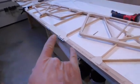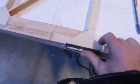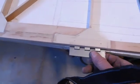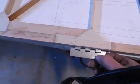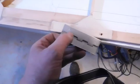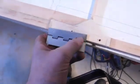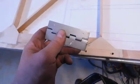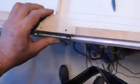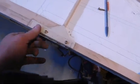I've got three hinges in and I'm just putting this one in now. The hinge is in there and I've got the two spots marked where I'm going to put the screws. Then I just take a drill and drill through the wood and just start going into the metal. Then I'll pull the hinge out and take it to the drill press and drill it from there. I drilled those out - you pull this out and you can see just the little nubbins. That's where you take it and drill out to full size on the drill press. And there you have one hinge attached.